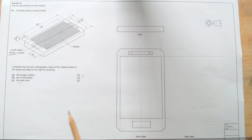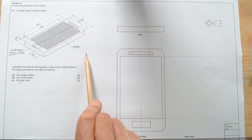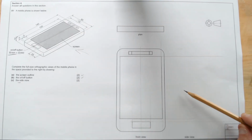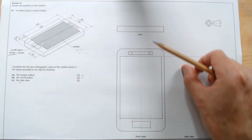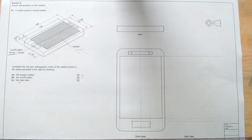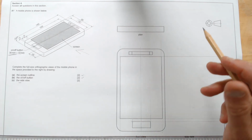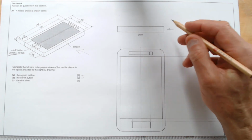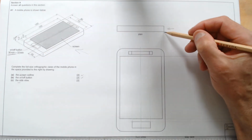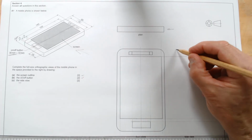The side view. Okay, so now you've got the side view looking from here. Basically looking from this direction, you would see that. All right, so now to get the width over from the top view, there are many methods to get that. The first method is just simply taking that measurement. Since you're standing over here, you're just taking that measurement, which is 10 millimeters in this case, and anywhere here, you can just do a point.